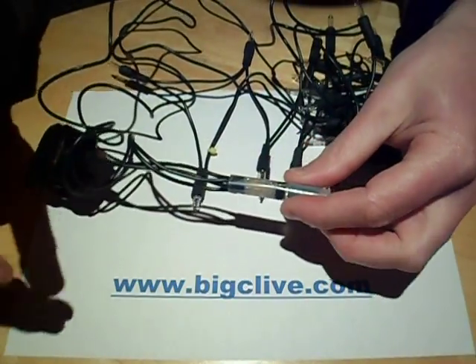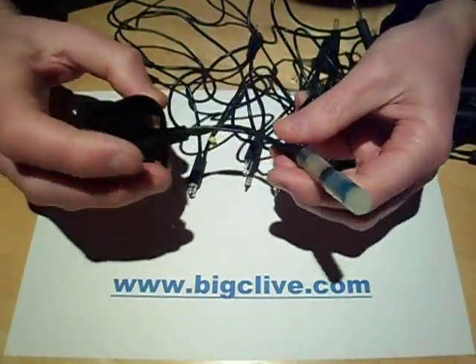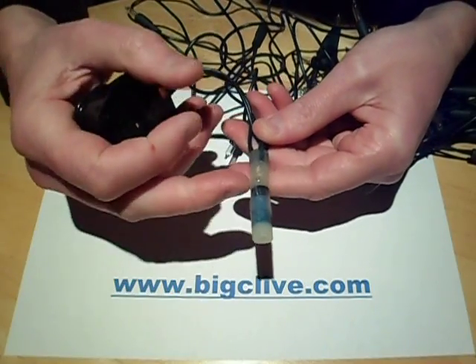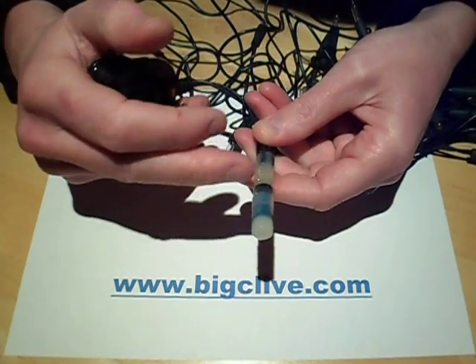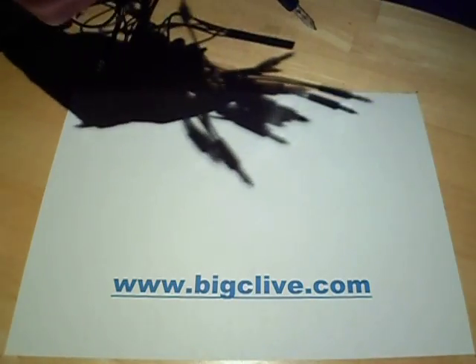So I've built this little inline power supply — a bit messy, a bit chunky, but that's just because I've added a filtering capacitor which makes it bigger. This is four resistors, a bridge rectifier, and an electrolytic capacitor. I'll show you the schematic for this.